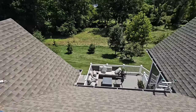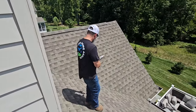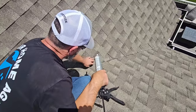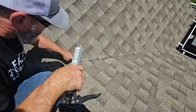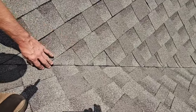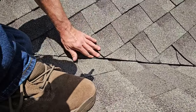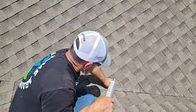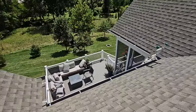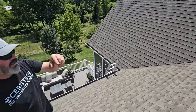That section is shingled differently — that's a cross weave, and this here is a California style valley, which we don't install. The California style valley has a shingle that runs this way, and then they run a shingle across over top of it. You'll see these little triangle spots where the shingle is missing — it's a quick way to put a valley in but it's not how we do it in this area. You can see how it catches all that dirt. It doesn't necessarily mean it's wrong, but in this area we typically do a cross cut at the bottom with one on top of the other, coming into a weave valley.